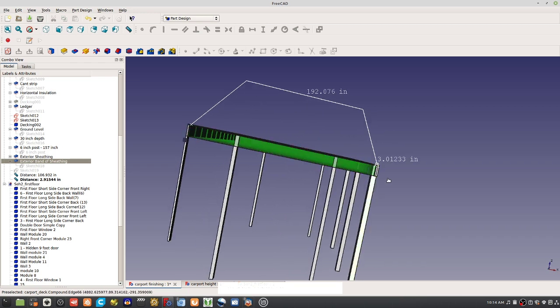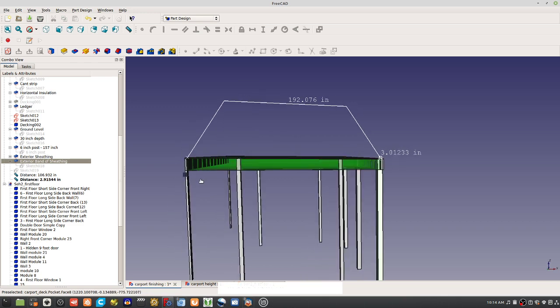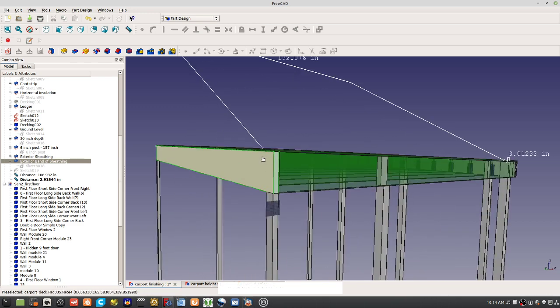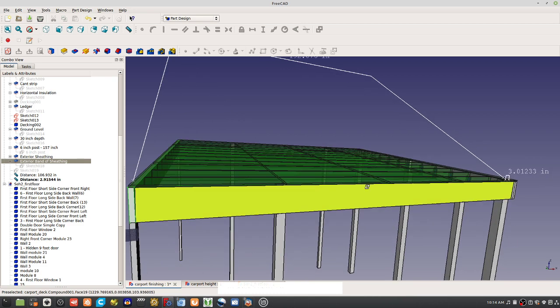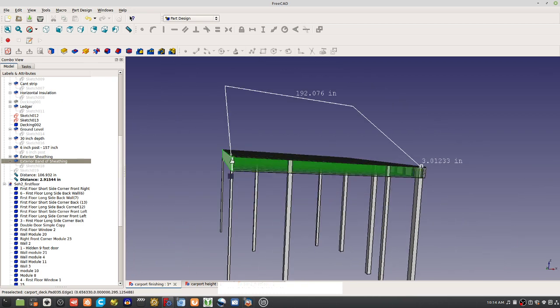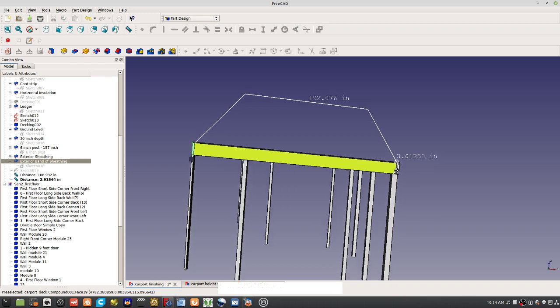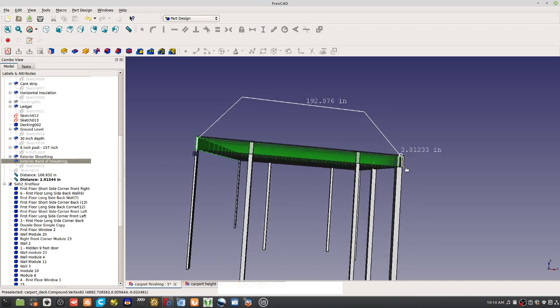So we're gonna cut these posts to length. There's gonna be holes there. The ledger is gonna define, so the ledger makes it unambiguous for where one part of this carport is. That's definitely there, and we know the exact location. Now everything's up in the air here. But the point of reference would be making sure that you've got that 4 inches of drop. And what's the easiest way to do that?